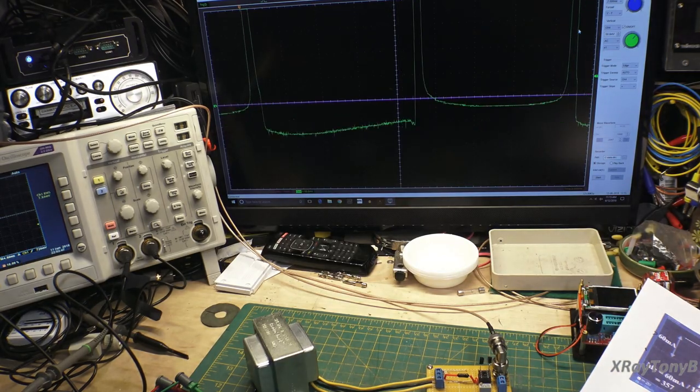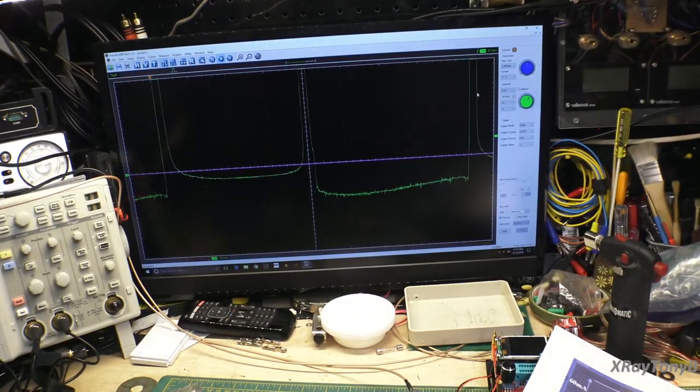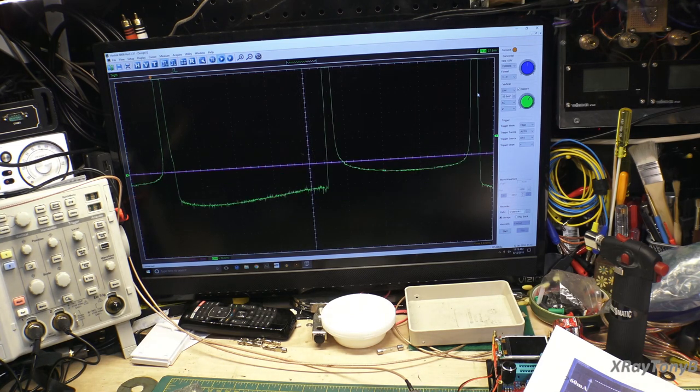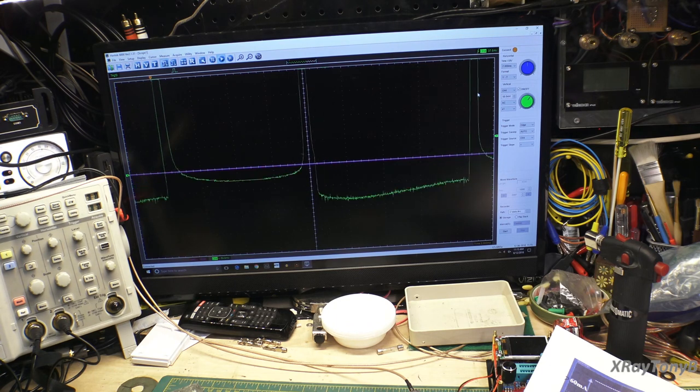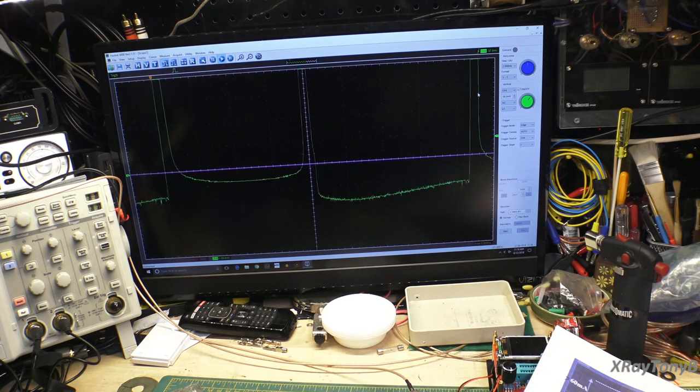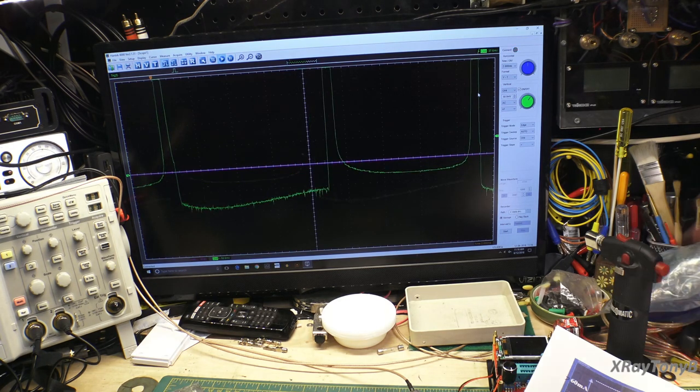What happened? Crazy, huh? What you're looking at now is a set of transistors whose characteristics do not match. This is an unmatched pair. Now, again, if I just go by the part number, they're both 2N3904s. And this is an extreme example of two transistors that are nowhere near the same as one another, even though they're both 2N3904s. This is why you can't just buy a couple of transistors with the same number on them and whack them in there and not worry about it.